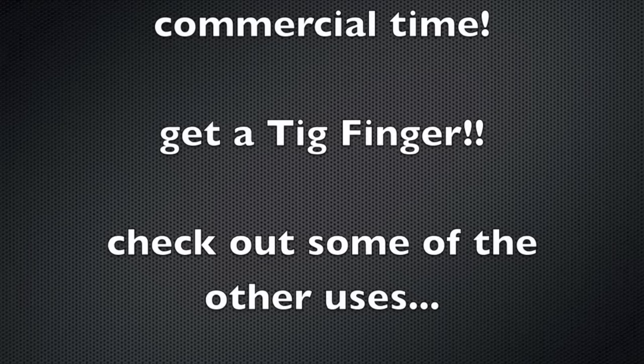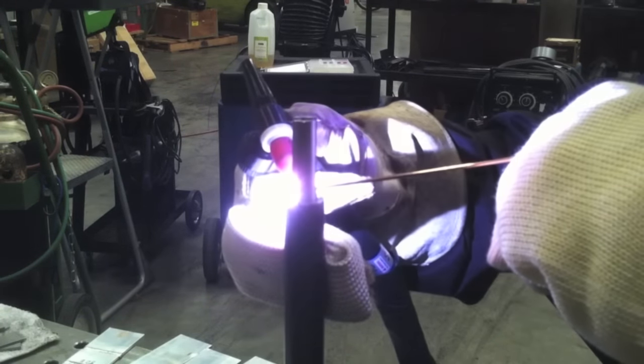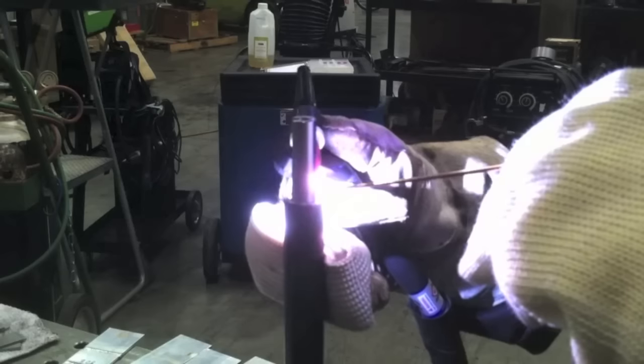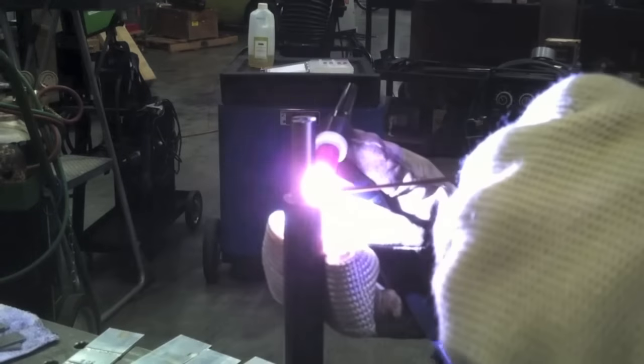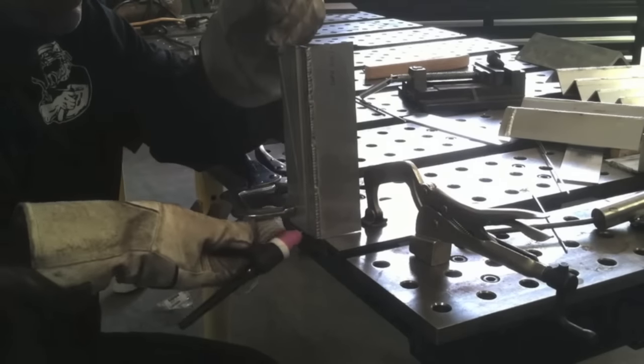It is time for the TIG finger commercial. I make a video every week and the only way I can keep doing it is to make a little money to fund the project. I've got a product called a TIG finger — it's a good product. Here are some applications where it really comes in handy: something small and round where you need to prop close to the weld and slide smoothly while making precise torch movements. Small socket welds where you can't walk the cup, or your cup keeps slipping — just put the TIG finger right next to the weld and you've got a prop at any given time.